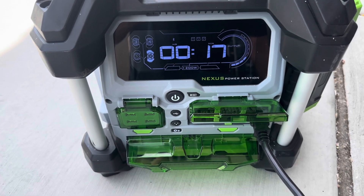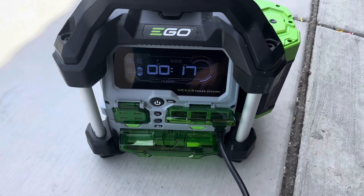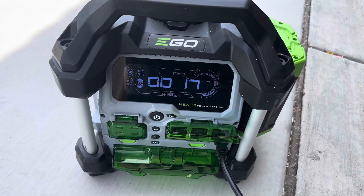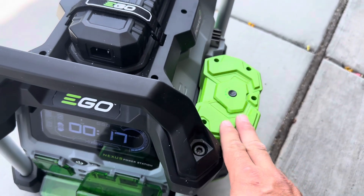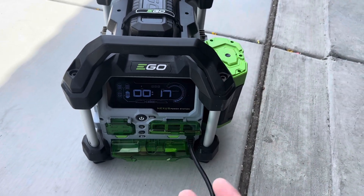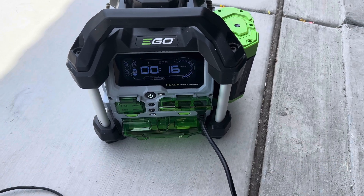It's saying we have 16 to 17 minutes at 600 watts. On low it says about 17-18 minutes pulling 600 watts. So on average it's thinking it only has about 180 to 200 watt hours of power in it — it should be over 200. We do have an efficiency gap because there's an efficiency drop converting the battery voltage. I believe efficiency is around 90 percent, so that would put this over 200 total storage watt hours.